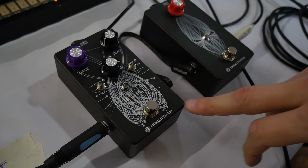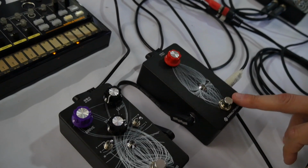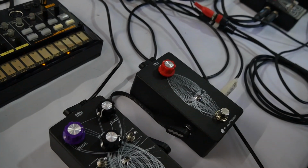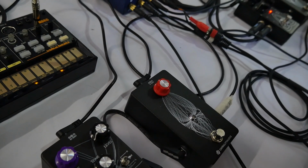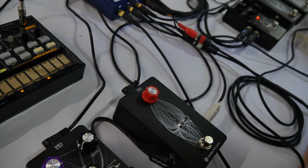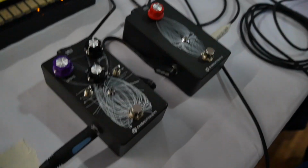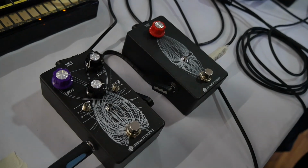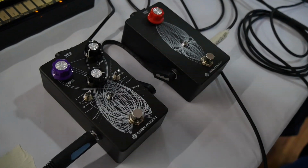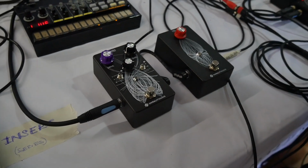The Splinter is an overdrive. The Black Swan is a distortion fuzz. The pedals are classic stompbox format for guitar. We use them on guitars, bass guitars, baritone guitars, but they work pretty well with synths because all internals work on 16 volts with 16 volts headroom, plus minus 8. So they fit pretty nicely with typical synth-like setups.